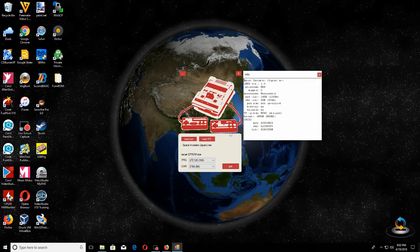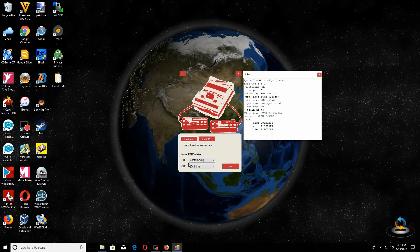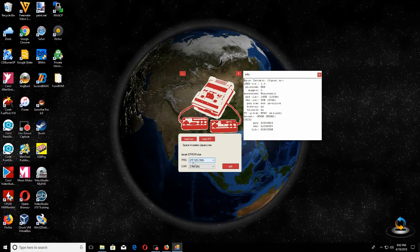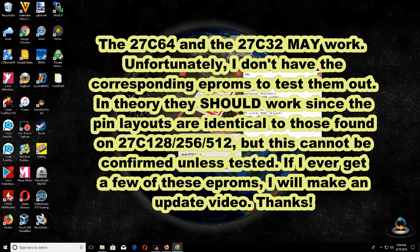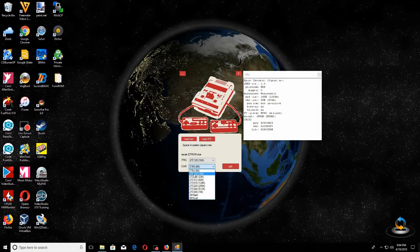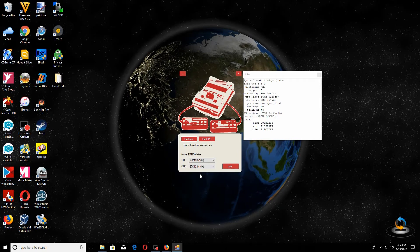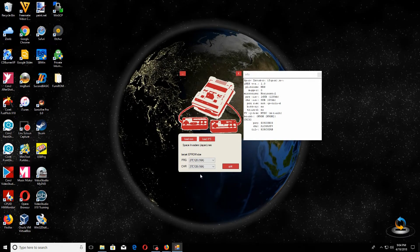There's a problem here. Notice that down here, it gives you the same information, plus it tells you what type of chip you should be using to make it compatible and make it work on the repro. Even though we already know the 27C128 will work on the Muramasa board, the CHR will not because it's a 2764 and it's not compatible with that type of chip. So all we have to do is select the one that's not compatible and jump to the one that is — the 27C128. You click that and it's going to output two files, and you need those two chips in order to create the repro. It's a way to make it compatible with the board.